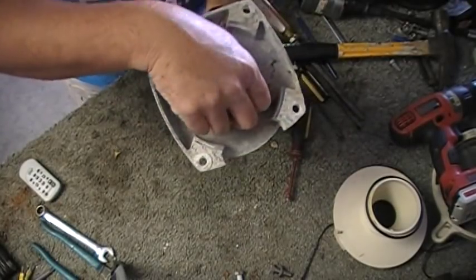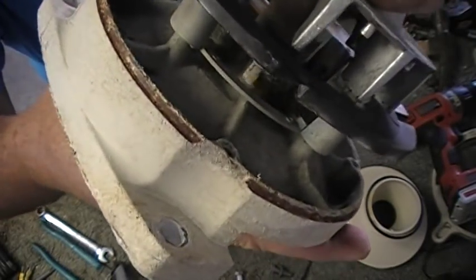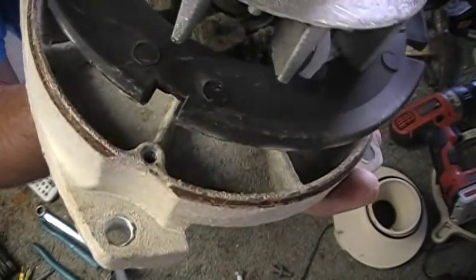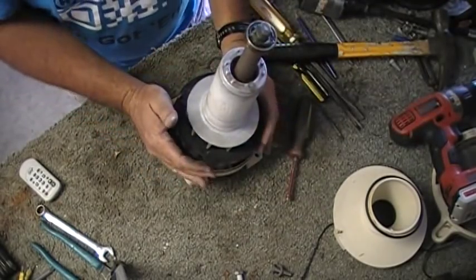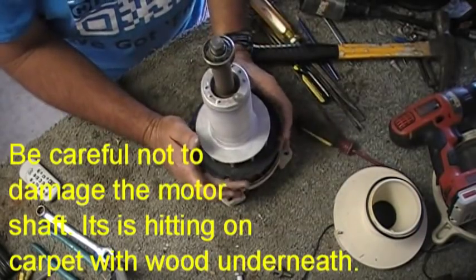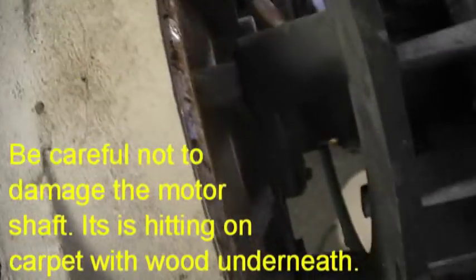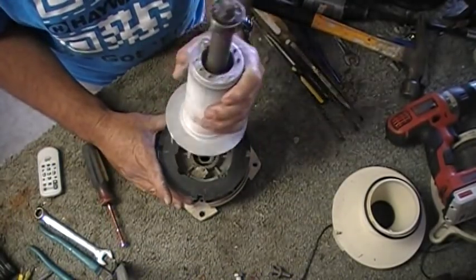This is just turning a little device in the back here. Remember that this is what locks in the bearing and keeps it out. So now we have this sitting. I'll just slam these things right on the workbench, and as you can see, I'm starting to get the bearing out of here. A few taps and we're out.